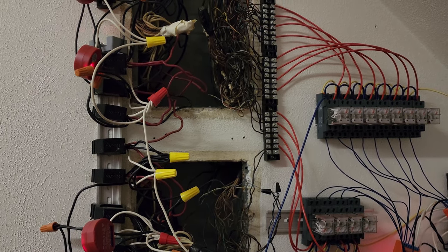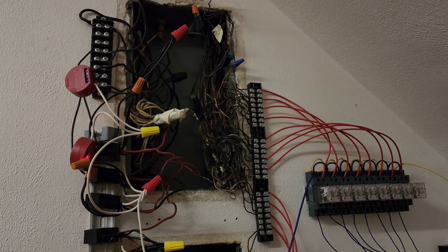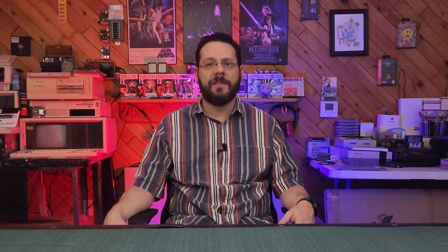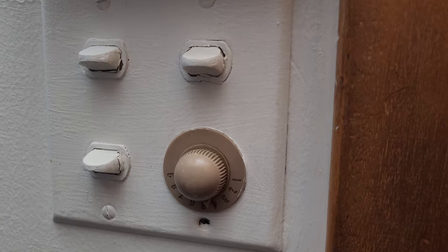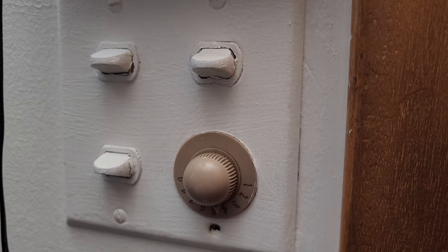There were originally 24 relays in this system, but a few of them got combined by previous owners or their electricians as relays failed. Because the switches are all single-pole double-throw momentary switches, or rockers in other words, they can simply be wired in parallel to one another to operate the latching relays that actually turn the 120 volt circuits on and off. There's another cool trick you can do because of this. Remember the dial? It's a double-pole rotary switch that allows you to send two wires switched by the above toggle to any of nine different relays, giving you the ability to control nine circuits from one single-gang switch arrangement. It's pretty brilliant, and it was built in 1954. For more on that, be sure to check out the first video that started this channel. Link in the description.